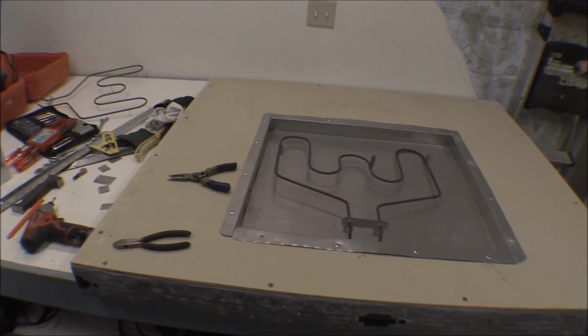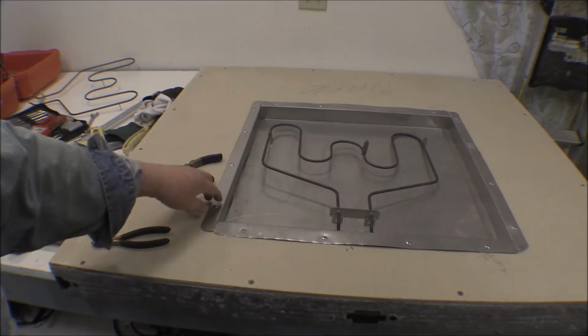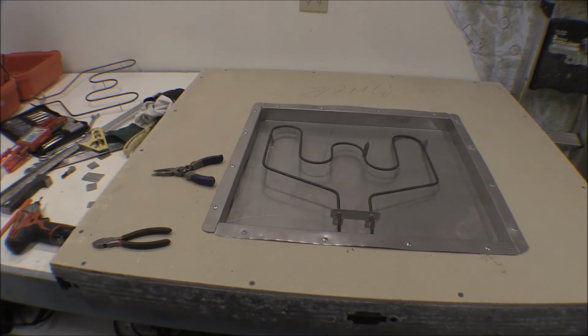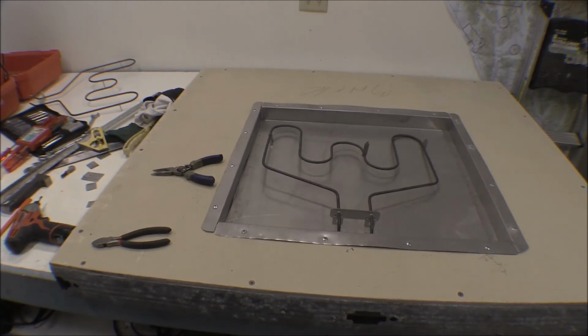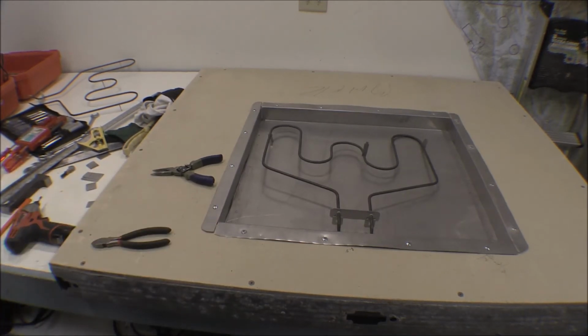So it spotted that stainless. I got a little cratering in there, and the probes are sticking a little bit because the tension is a little too much on that when I clamp it closed. The way the tension is on it, if I loosen it up to the point where it can get the correct tension, then the nut on the little arm interferes with the handle as it goes up and down, so I wind up with a little too much tension on there, and so it craters and it sticks a little bit, but it's working pretty good.